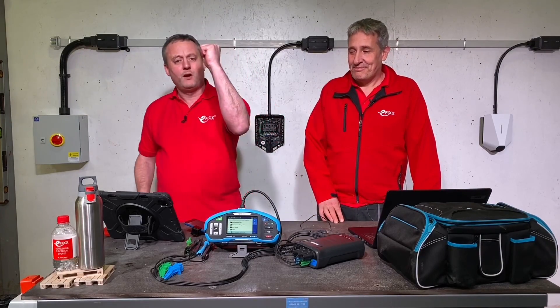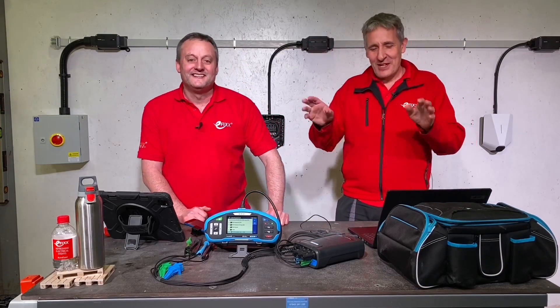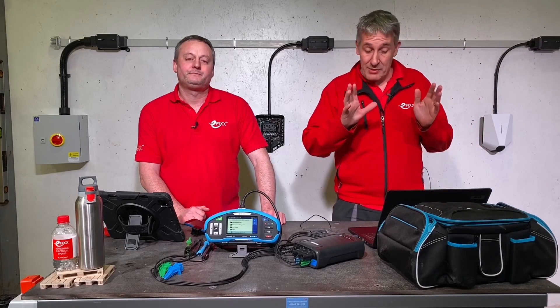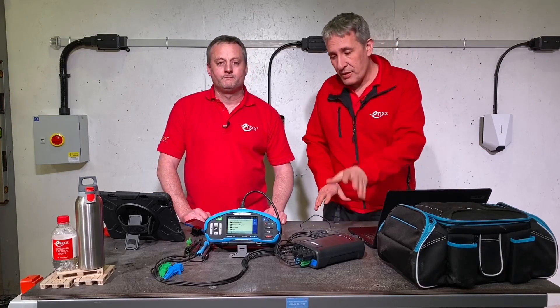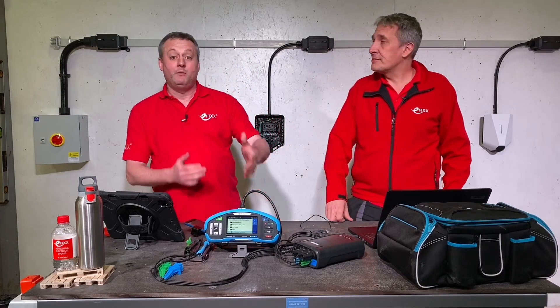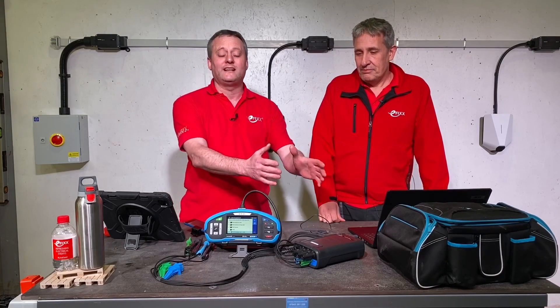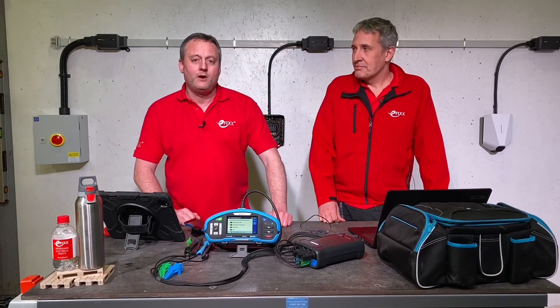Did that kit make your life easier, Gary? Absolutely - I can see myself sitting in front of a three-phase distribution board, clip on the neutral bar, clip on the earth bar, three probes into my three-phase breaker, set it off, do all 10 tests, move to the next one. And I'd love that workflow - build those tests for Gary, pack him off for a day, and he comes back and downloads the hopefully satisfactory test results. That just shows what a powerful package this is - the software, the three-phase active switch, and the Metrel 3155. We love products that save electricians time, and we believe the three-phase active switch will do exactly that. Have you been using the active switch? Leave your comments and help others in the community.